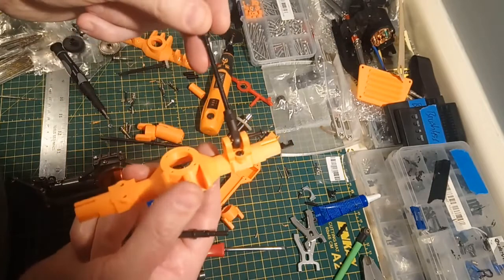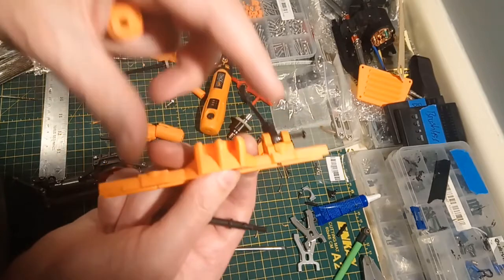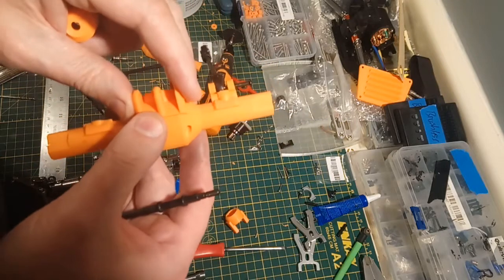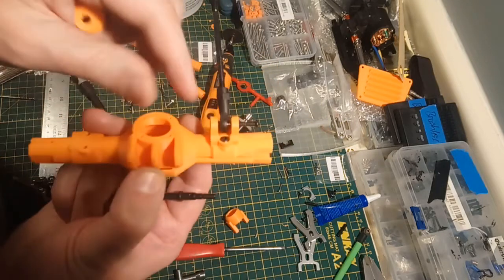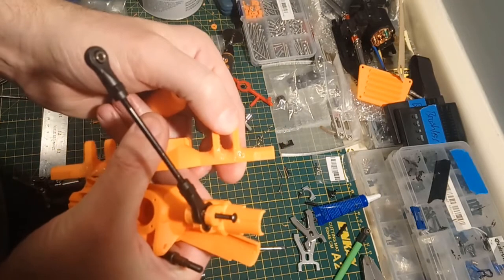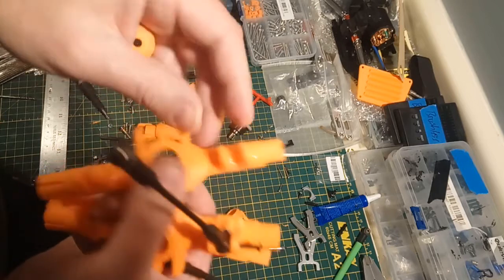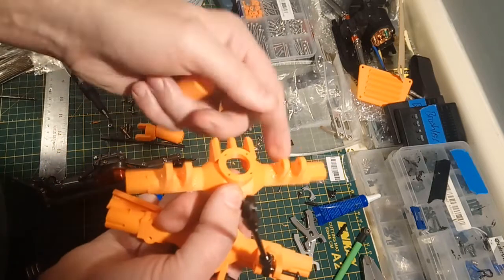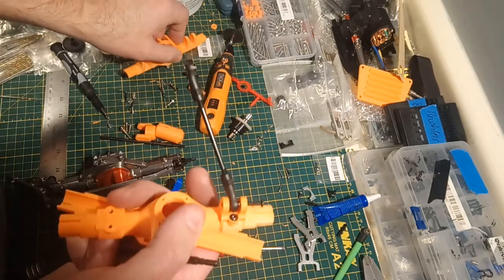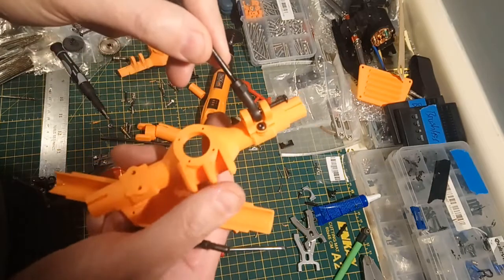What you need: if you're going to make two axles, you need two of the front half with the link mounts and two of the back half without the link mounts. This one doesn't totally cosmetically jive with the other because I changed the link mount — this version has integral link mounts, and it's weak. It broke really easy. You can see there's a bunch of hot glue on here. Basically, you print it lying down, these are vertical, and the layer lines are a major point of weakness.